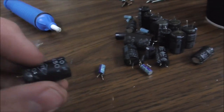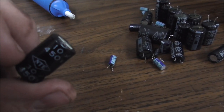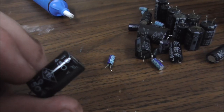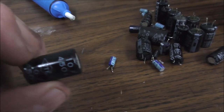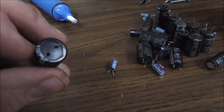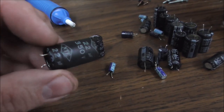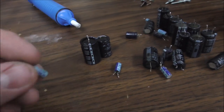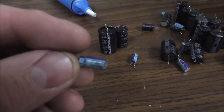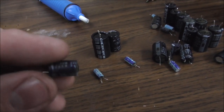These are all the old caps I've pulled out. Some of them were the wrong value for voltage — like this one was a 10UF 450 volt, but it's supposed to be a 10UF 25 volt. Overkill, but it'll work. So somebody had done a cap kit at some point. But all these small ones had never been replaced — when they did their cap kit, they didn't bother with anything tiny, which is a mistake. Sometimes the tiny ones will bite you on the butt.